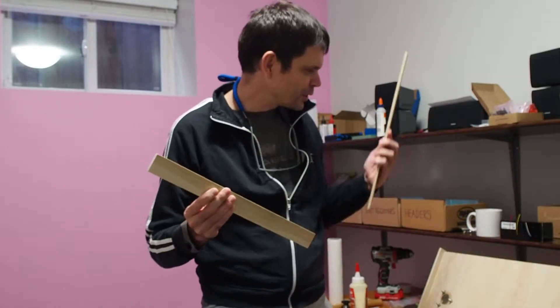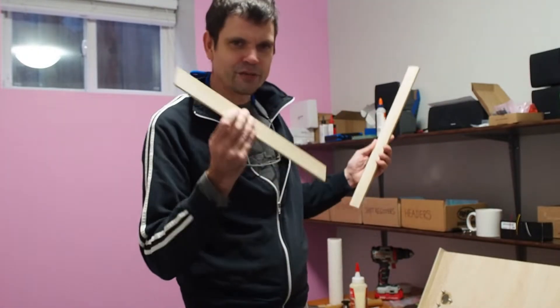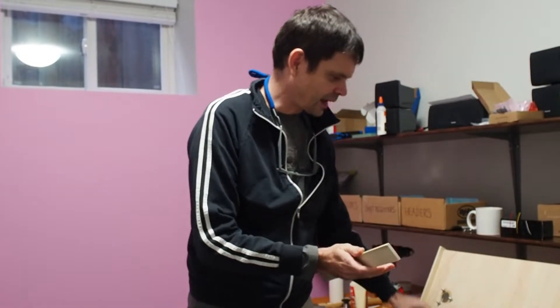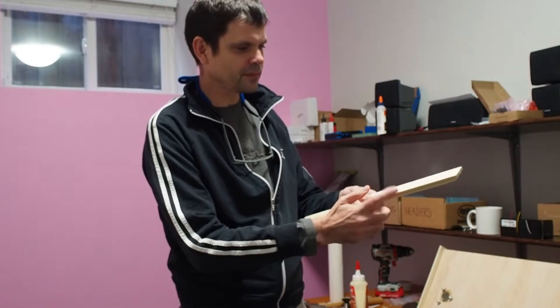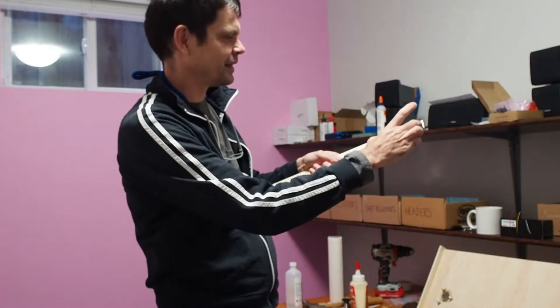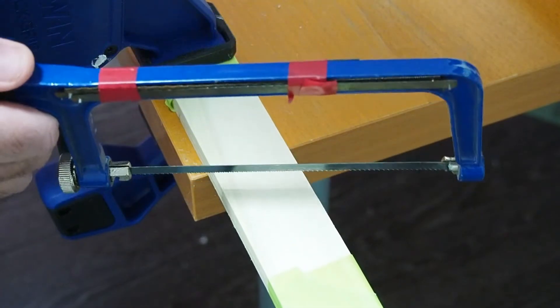Or do I? Because I came up with something — I think it's pretty smart. If I take my piece of wood and add another piece with the extra length, plus the width of a saw, tape them together, I can make a diagonal cut anywhere at any angle. These two pieces will join up to form the exact length I need. I can even have a non-straight saw line and it will all work out.